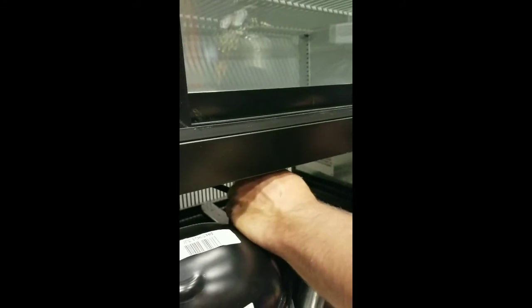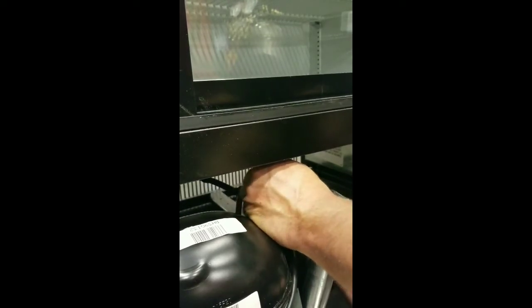The brown went to black. They have these new wire nuts. These could be flipped up. Levers on them. Flip the little lever up. Take your fitting, shove it all the way in, and give it the tug test. Now we gotta find where the blue went. The blue goes to white. This is on your condenser fan label. Make sure we shove it up far enough in there. Snap down the lid, give it the tug test, and then we're going to get this last green one to ground.